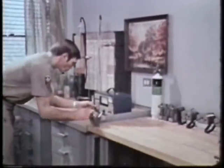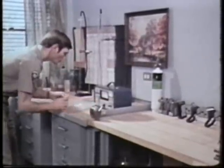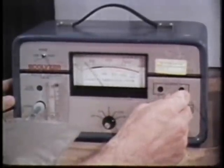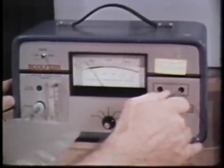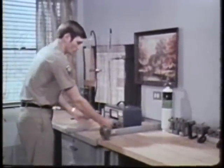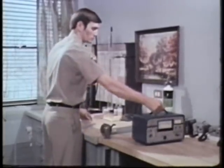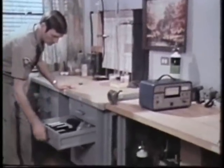Attach the plastic bag to the intake port of the analyzer. Adjust the meter so it reads exactly the value shown on the cylinder. With the flow rate adjusted and the calibration set, the analyzer is ready for use. These adjustments should be made each day you use the instrument, because the settings may drift.